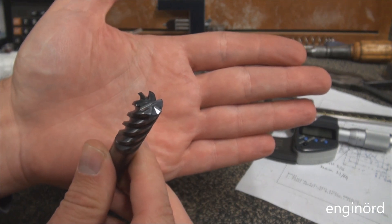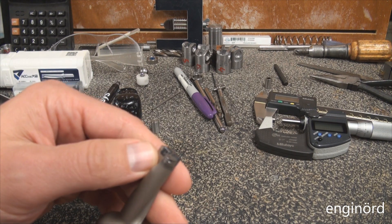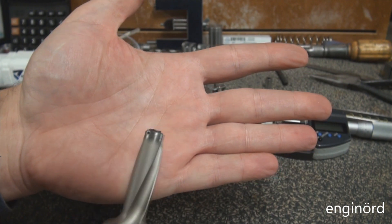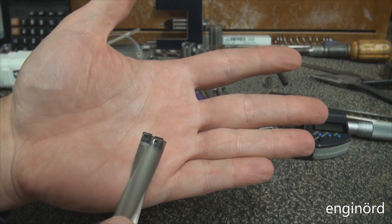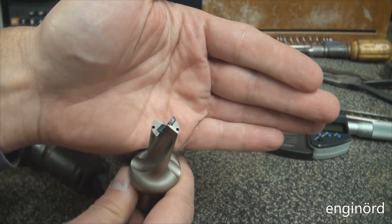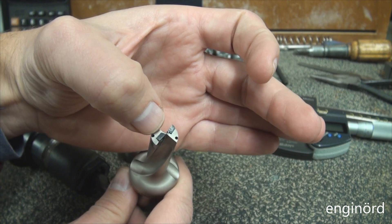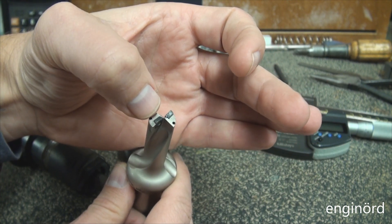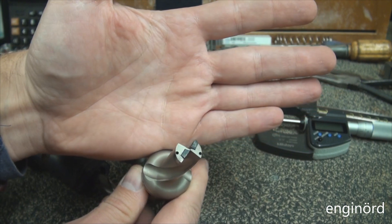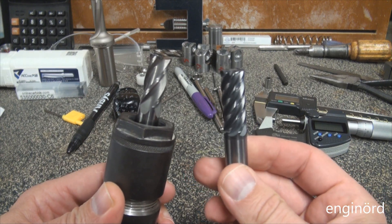My initial idea was to use this tool here which can do both drilling and milling operations, but after doing some testing I wasn't really happy about the performance. I think the main drawback is that it's designed for use with coolant - you can see the coolant holes here and here - which is supposed to evacuate the chips. Since it's not evacuating the chips it was cutting and re-cutting, and that's why the surface roughness wasn't to my taste. So let's go change this tool out and let the hogging begin.